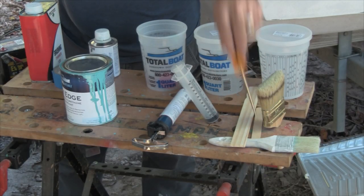I've got it completely hand-sanded now using 220 grit, all by hand. I'm going to wash it down using a mixture of ammonia with Dawn, hose it off, let it dry. Tomorrow I'll wipe it down with acetone and then we'll put the final coats of polyurethane — classic whaler blue from Total Boat. So we've sanded it, washed it down, getting ready to put a final coat on. Before we do that I'm going to wipe the whole thing down with acetone. I will be using safety gear because it's quite strong, as are the thinners I'll be using in the final coat.